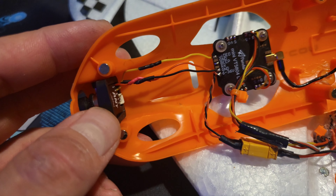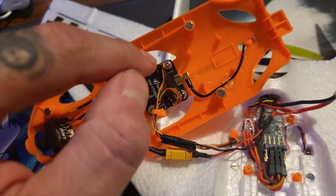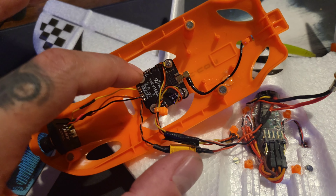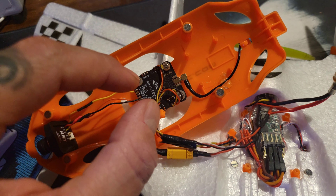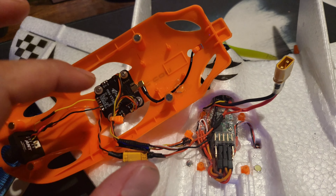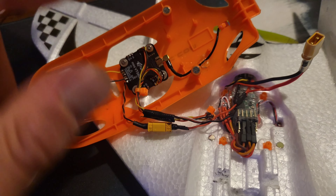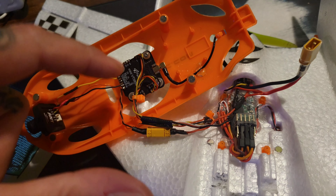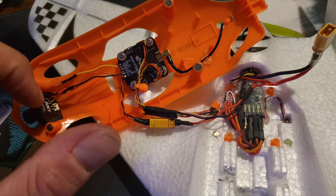All the magic is under the canopy here. I've got a Cadex Ant — don't need anything more for what I'm doing. I don't need to see tree branches and stuff like that. The Panda RC — I forget the model number but it's a VTX. It has four LED outputs, traditionally for a quad's arms, and it has a beeper built in that you can wire right to. I ran power directly to it and tapped off the top and bottom pads, running everything to the Ant, which can also handle the full voltage.